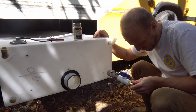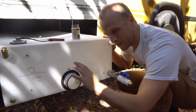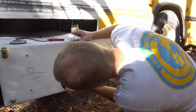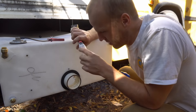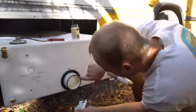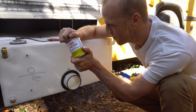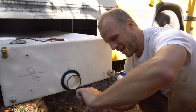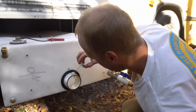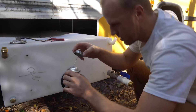While we've got the tank out, let's glue the dump valve and shoot some water in to see if any of this leaks. I'm going to put some silicone on that seam because it'll be inaccessible later. These also tend to leak right here so I'll put silicone on here as well. Residential code says you need purple primer for your PVC, but we don't really care about residential code — get yourself some clear cleaner slash primer. Once you put this PVC on you only have about 10 seconds until it's sealed up, so be aware of that. You're supposed to hold your pipe in for 30 seconds because it actually pushes itself out.